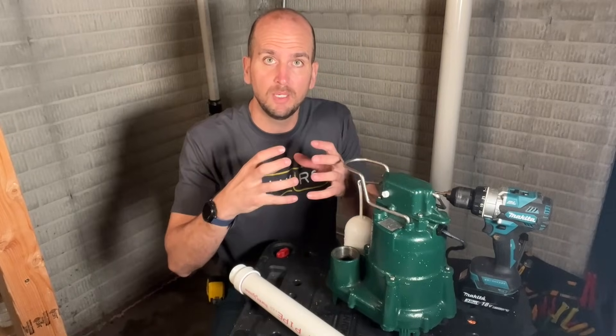This is a very common principle in any sort of pump, and that's why often if you're dealing with pumps, sometimes you need to prime the pump. You need to get hydraulic fluid or water, or whatever that fluid is, into the pump so the pump can actually start working, because it's completely ineffective if the impeller is in air.